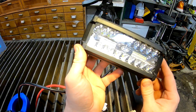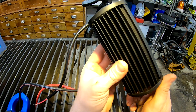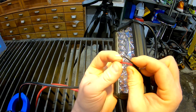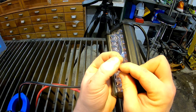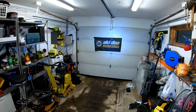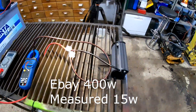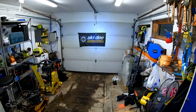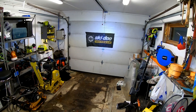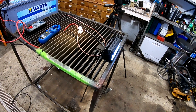This one I bought for the new tractor — the Valmet — thinking it could be the front lights. eBay says these are 400 watts, but if I look at the wires I don't think they are thick enough to support 400 watts. Let's see — this one will be interesting. It's lit up and we have some light on the garage wall. We are at 13.5 volts and 1.1 amps — quite a way from 400 watts, that's for sure, and the light is not nearly 400-watt equivalent. This one cost around $12.